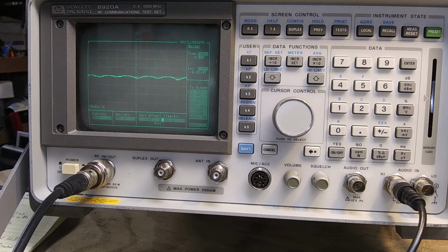Okay. That just about completes the RF alignment. There is one little footnote. After reinstalling chassis and cabinet, switch to the broadcast band and tune in a weak station near 1400 kc and retouch A7 for maximum volume. I don't know how I'm going to reach A7 once it's back in the cabinet.